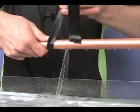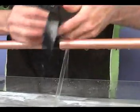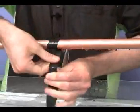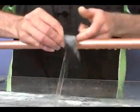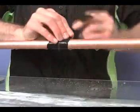Wrap the tape around the pipe, overlapping the previous layer by approximately 50%. When applying the tape, it is essential to keep the tape under tension at all times. The stronger Crack'n Tape is stretched, the tighter the seal will be. If the tape is not held tight, the water or pressure or liquid will simply flow straight underneath the tape.